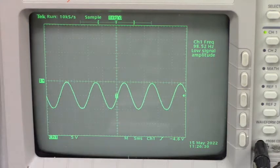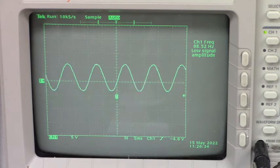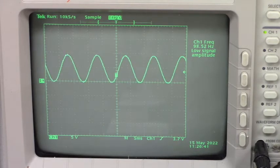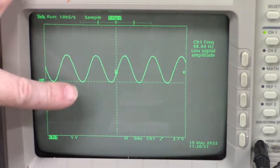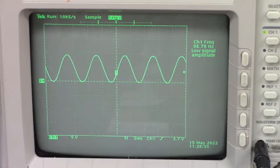Let's go the other way - raise that trigger point. Now the peak of the sine wave is at plus 10 volts and the valley is at ground. That's amazing - amazing little circuit. You can add offset adjust to your function generator that does not have that option.